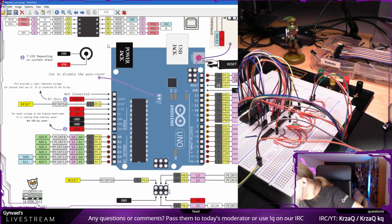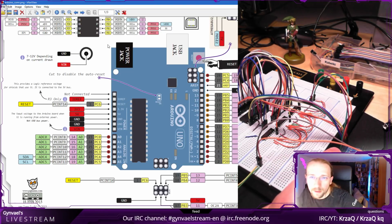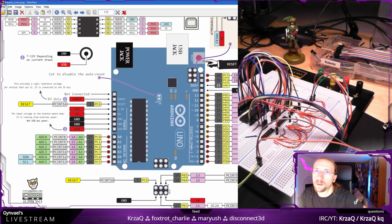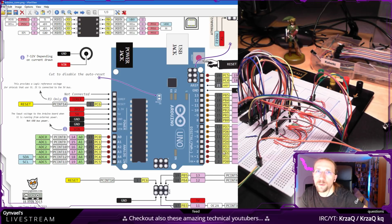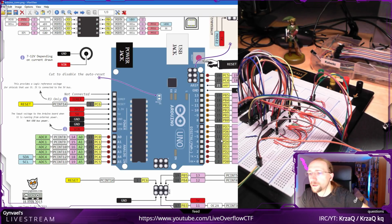Then, yeah, the serial lines are connected, the shift register is connected here. Which is fine. These look like typical I/O pins. Then the data is connected here, which is all in the PD bank, which I hope will be visible as one register, one global variable inside Arduino. If not, then we can do some bit manipulation, but whatever. I don't want to do it if that's not needed.